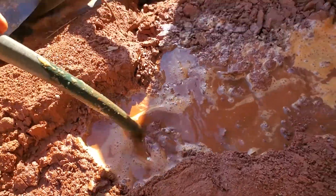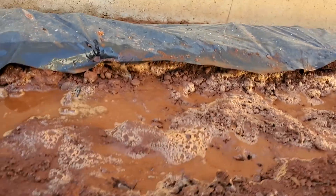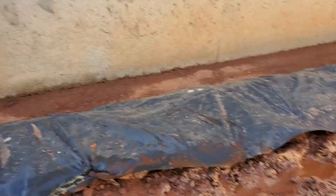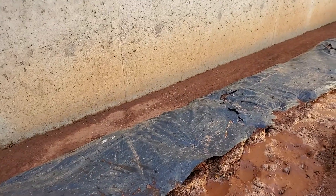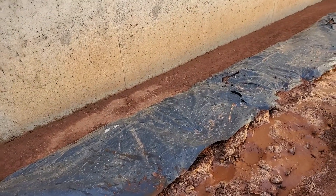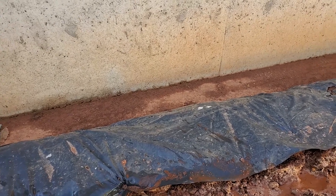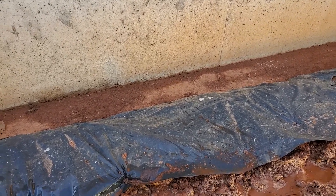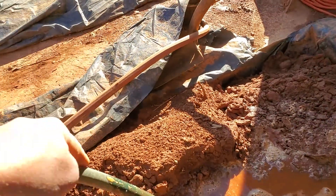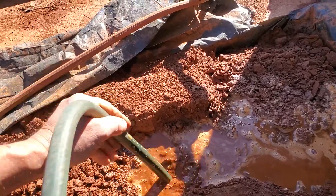This is one of the great ways to compact your soil. This dirt was all up high and you can see it's dropped down about an inch. That just means if you were to pour concrete over that before you compacted it, you'd have a big cavity under your concrete — and that's why sometimes you jump on concrete and it sounds hollow underneath, because it is hollow underneath.